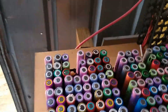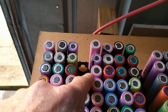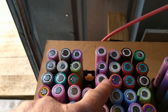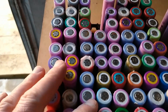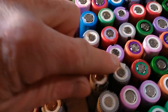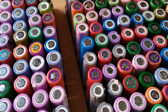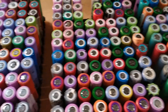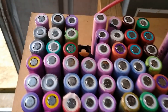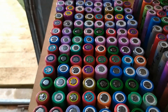When you put them together, just double-check and make sure you have your layout correct — my gap was in the wrong row, and luckily I didn't put them together. Also check your batteries: make sure they're reasonably clean as far as stickers and bits and pieces go, because I noticed I had one battery in the wrong way and didn't see it properly. At this point I strongly recommend taking the time to check every single battery and make sure it's the right way up.